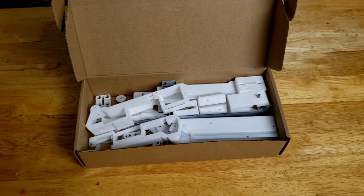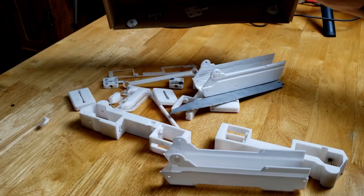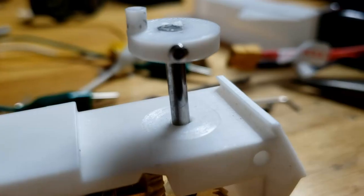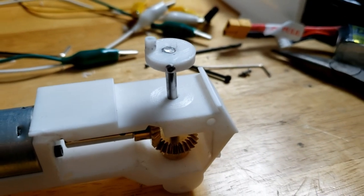So after a ton of revisions of designing the 3D parts, test fitting them, and trying out the mechanical motorized assembly, I ran into a few problems. One was that the moving plastic parts touching each other, since I printed them out of PLA, tended to melt and fuse together. So I corrected that problem, and then I got to a design that would work. Once I had pretty much all of the handle stuff figured out, the next step was to work on the blade. So from start to finish, this is what the whole build process looks like.